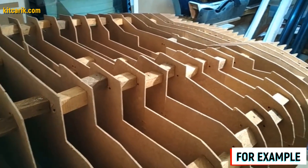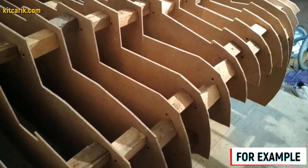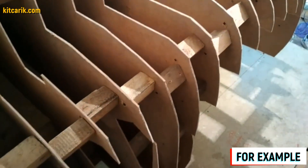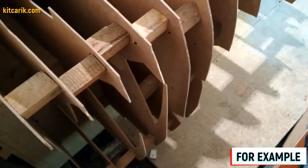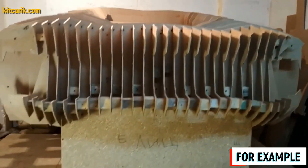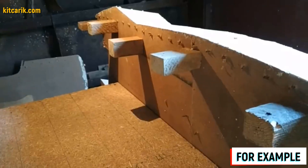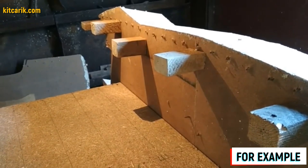Why this length? The thickness of the fiberboard sheets is five millimeters; the space between the main body sections with a step of ten centimeters is equal to nine and a half centimeters — the math works out. The same applies to the wooden blocks of four and a half centimeters. The front and rear fiberboard sections are numbered so during assembly we do not get confused.